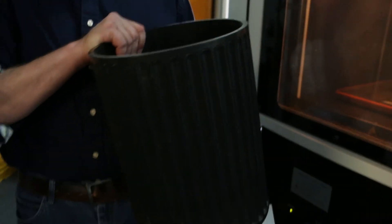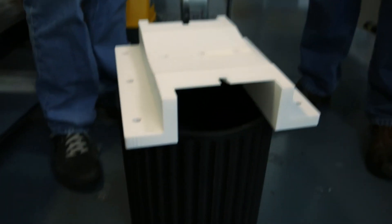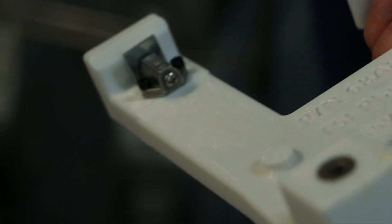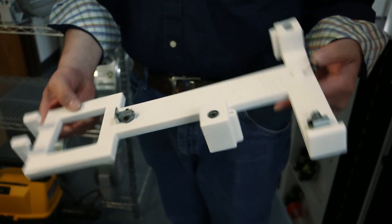Same type of thing on this — this was 13 slice also, all the way up, and you honestly can't tell. Here's an example of a tooling fixture that we did for a customer. This shows how you can combine technologies. We printed everything and then reamed out the holes, put bushings in for locators, and then we have some spring stops here to actually hold the part in place. What this does is position a part so they can glue a strap onto a plastic part. Just use hex-shaped holes, take advantage of the 3D printing as much as you can, put the text right into it. This is kind of what I did before starting the company — come up with fixtures like this, so this is kind of my background.